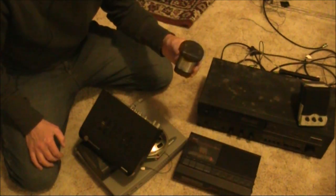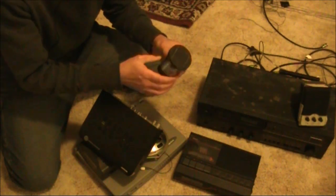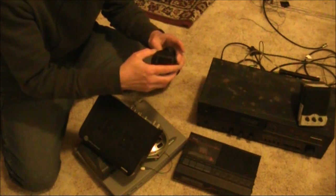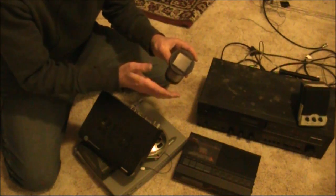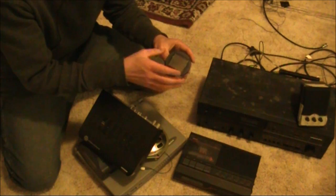Here is this little solar-powered garden light. These little solar cells only put out about one volt, maybe 100 milliamps or something like that, but you might be able to charge a AA battery or similar. Sometimes they have a regulator inside. May or may not be useful because you can get cheap solar cells from China that give you a lot more than one volt.